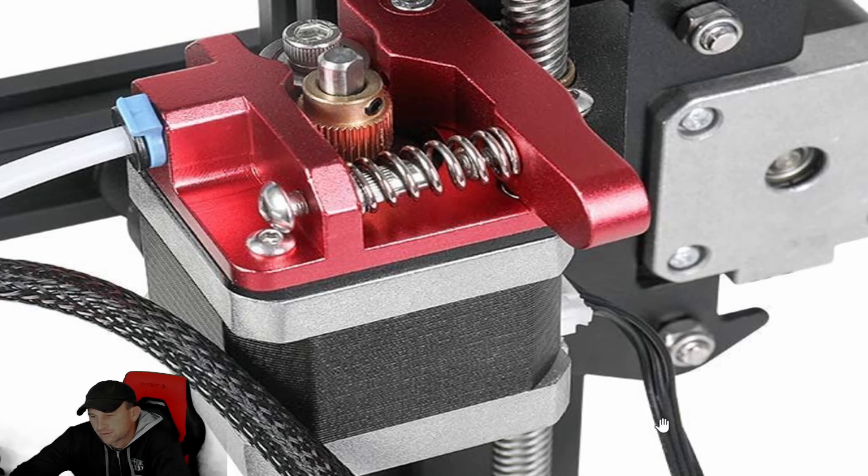Even the plug we talked about — don't pull on it and strip it out. You want that wire to be somewhat free-floating because there's a lot of up-and-down movement during printing, and having the wire tied down too tightly will cause a huge issue. We always recommend testing everything after you've installed something new or replaced something that malfunctioned — do a couple of test prints, confirm everything is working, and then start your real print.